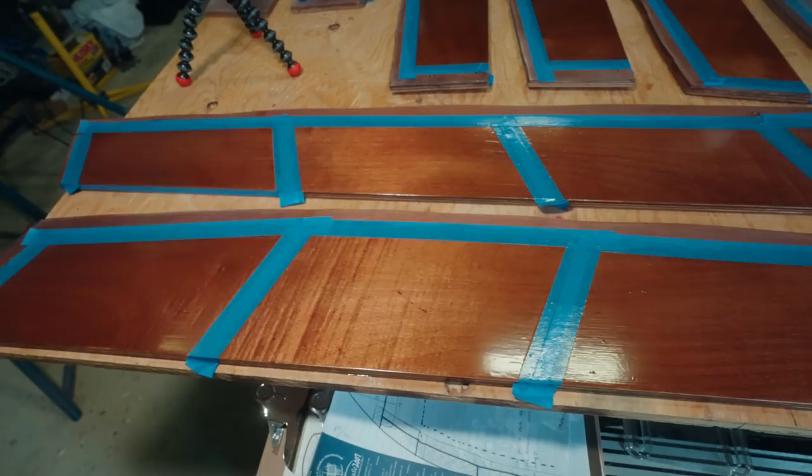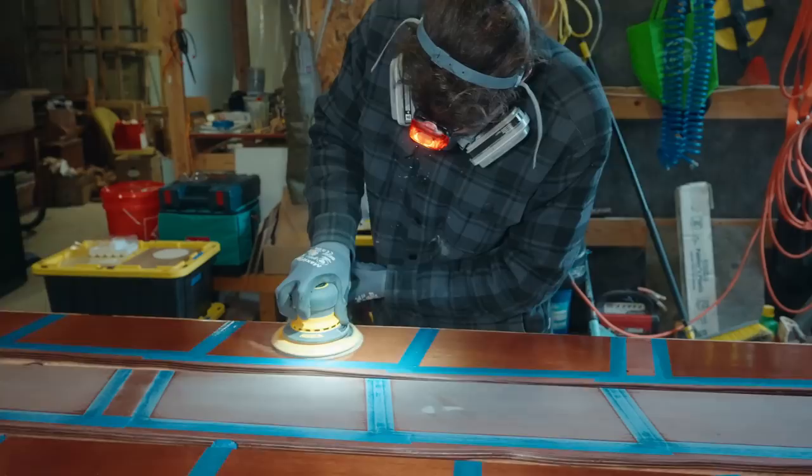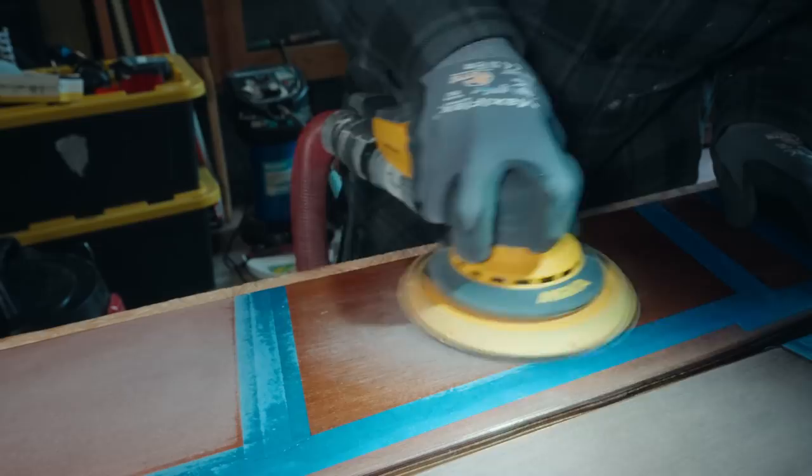Oh man. So we didn't wait long enough with the interval, we assume, and therefore the last coat didn't flow as nicely, and yeah, therefore the brush strokes can be seen. So since we are applying one more coat, I just scuffed it up with 240, and that goes really easy. We can even leave the tape on because the tape also has four layers on it.